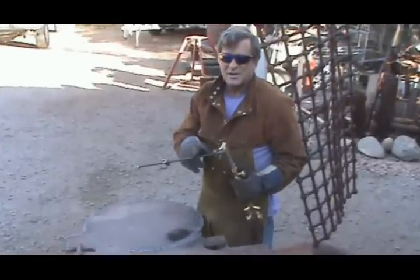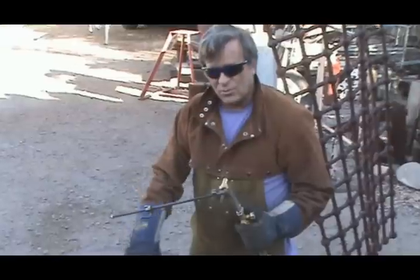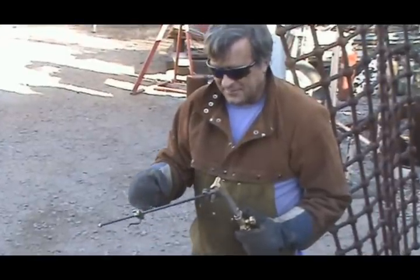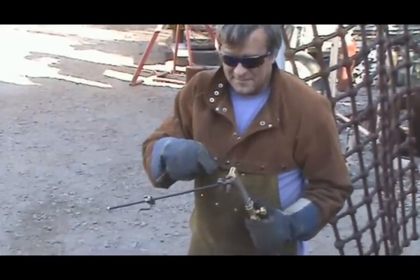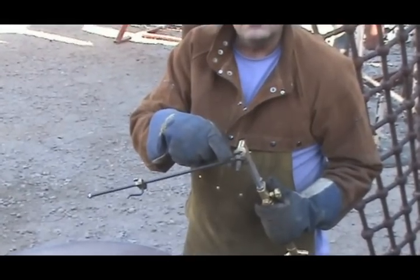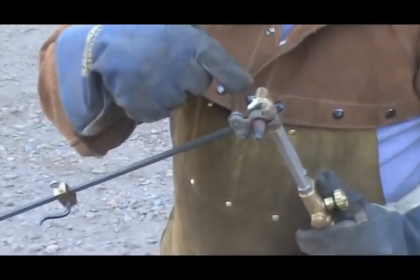This is my circle cutter off of my plasma cutter. Because the plasma cutter wouldn't work on this — the metal's too thick — I adapted it to fit my oxygen acetylene rig. Just a battery clamp, just almost the right size to fit on the cutting tip.